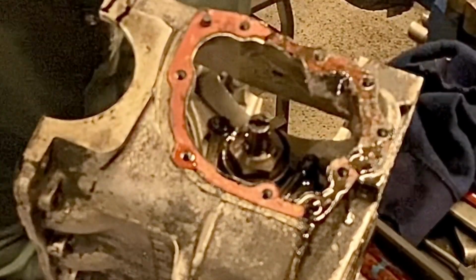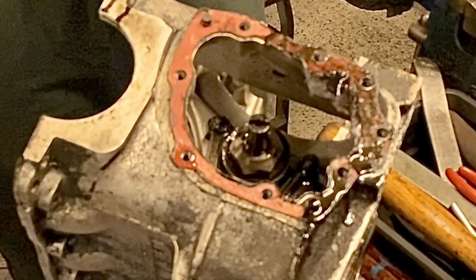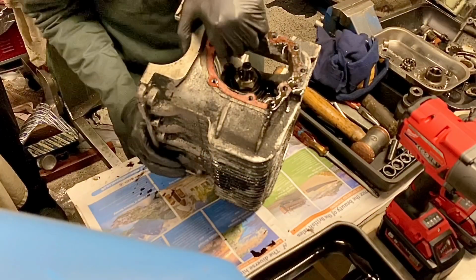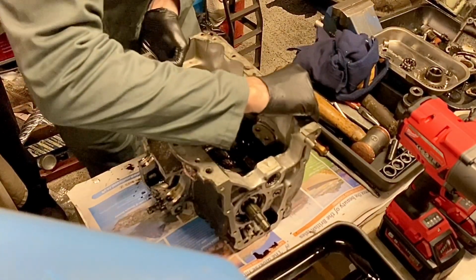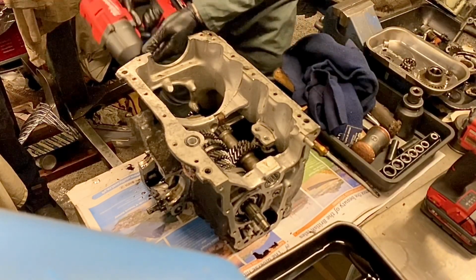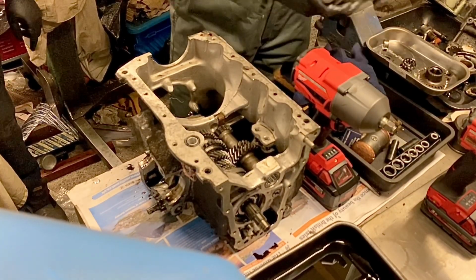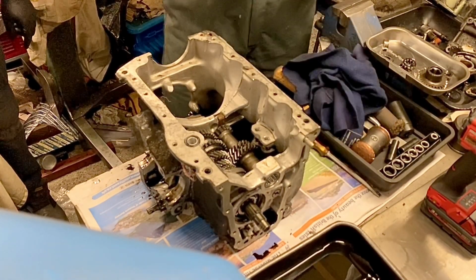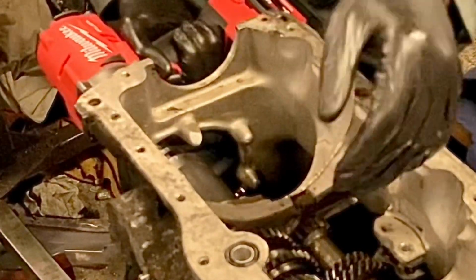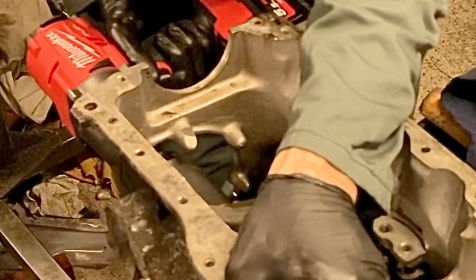Nice. Okay, so now what you need to do is put it back on the bench and position yourself ready to get the large socket on the end of the big nut gun again, and we'll take that big nut off. So we're still locked in 2 gears. Take the socket off the end and replace it with the big one that's in the tray. Make sure it's fully engaged and then give it the full beans. Same as last time, just wind it straight off this one.